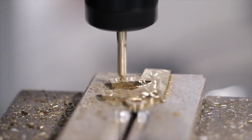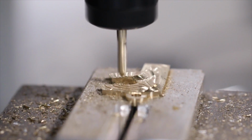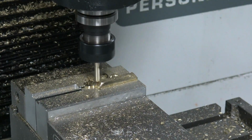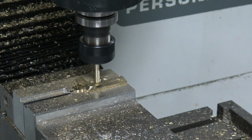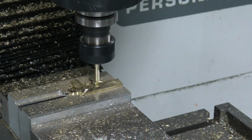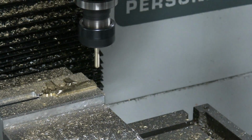The adaptive with Tool 31, the flat 1/4 inch end mill, can't get everywhere that this little 3/16 ball can, and that's the tool that we're about to use to surface this. And when we surface it, we want constant chip flow. We want to go faster. We want to avoid introducing that cutter to a big chunk of metal that wasn't removed from a prior operation. So by doing a 3D adaptive with rest machining, we can control the feed rate and let this cutter come in at a more controlled feed rate, get rid of the stuff that's left, and then here in a minute we'll see it does the parallel and it's smooth sailing. It's not going to hit any surprises. Here we go. Here's the parallel.